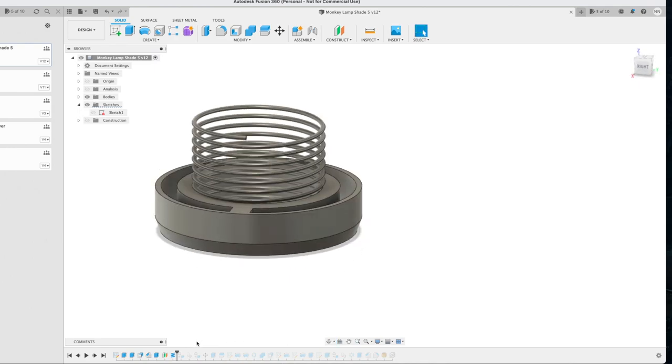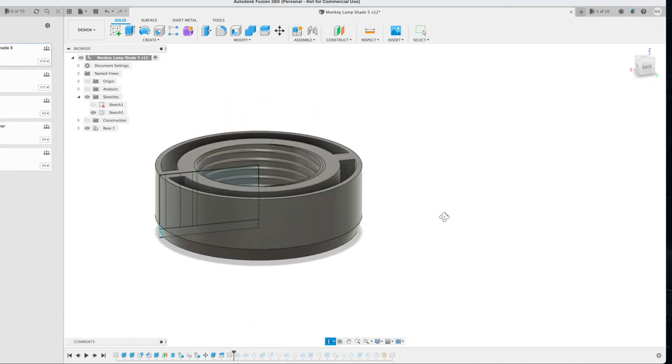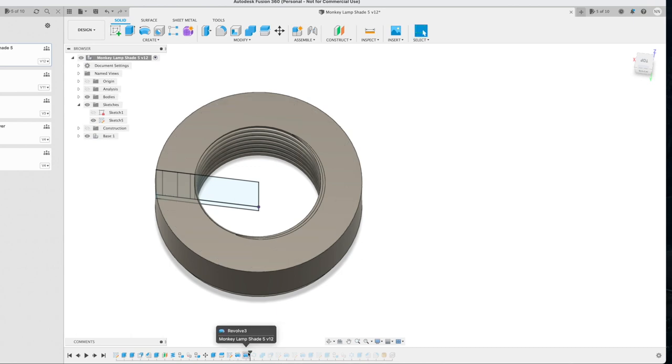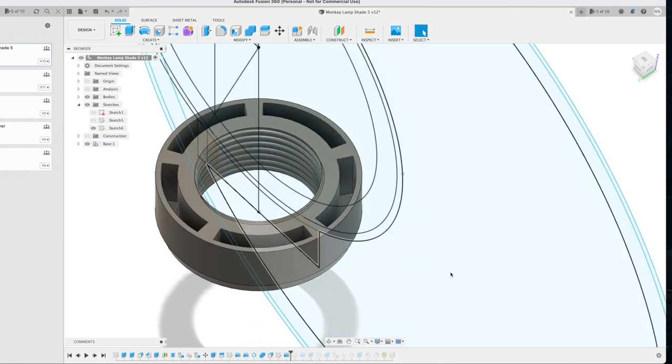So this is how I made the thread — move it into component and all that. Move it down, make the base a little bit bigger and cut the thread to size. Now the next sketch — I'm removing that part and adding the new five-section socket. I could have just used the parametric design but I had a lot of iterations, and it was a lot easier to just redo the steps rather than find them again. So now we've got our five-socket base.